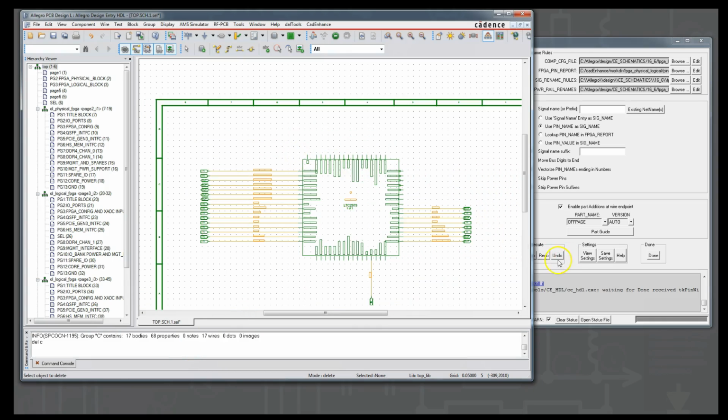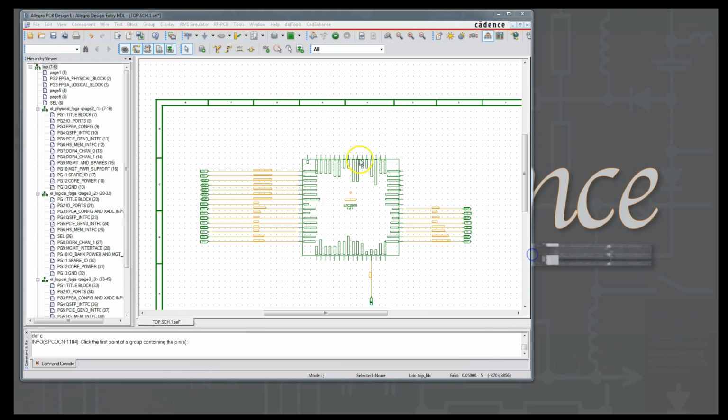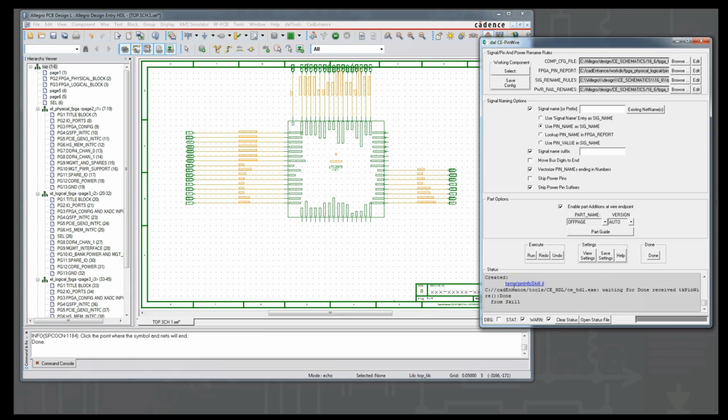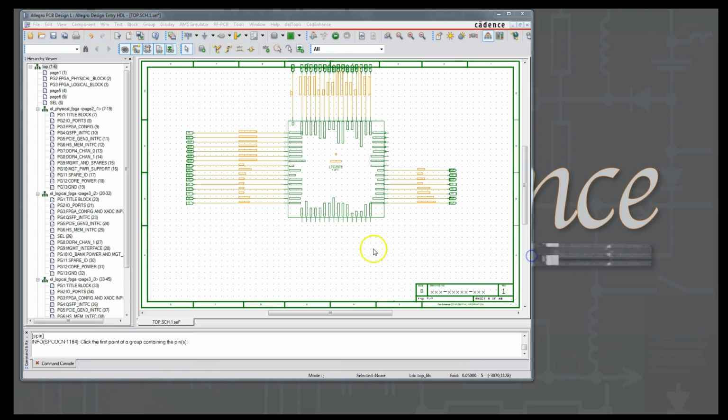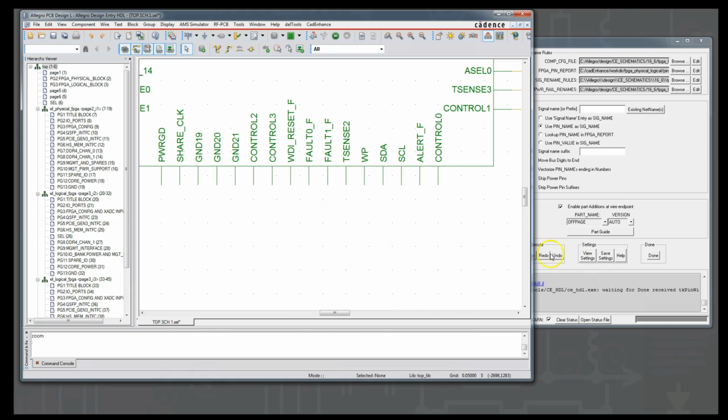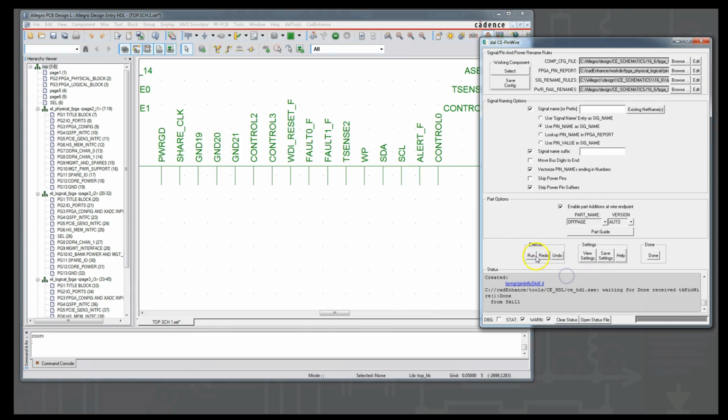Now let's draw a box and set the direction for pins on the top. And now we'll draw a box and set the direction for pins on the bottom. In one more case here, we will use the Undo button to get rid of the bottom pins we just added. Then we will carefully surround one pin and add a bottom wire to show how we can pick up just one pin if we want.